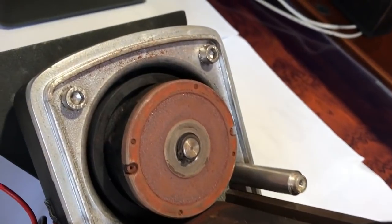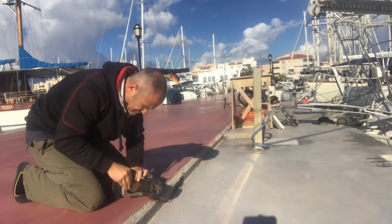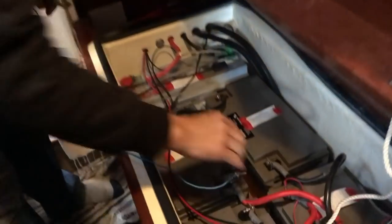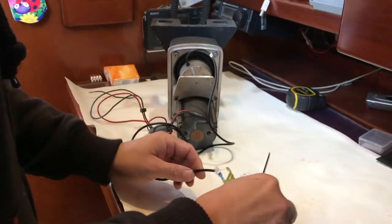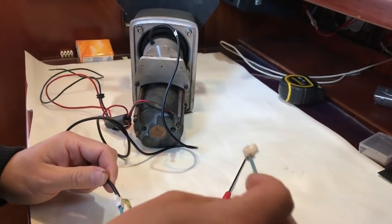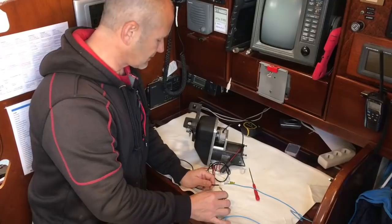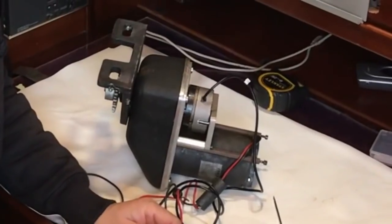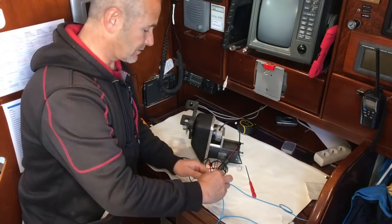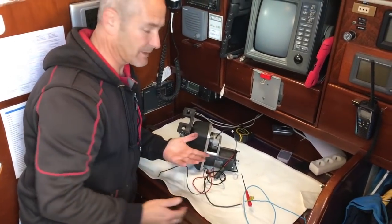After Ant's excellent tutorial I had the confidence to put it together and reinstall it myself. Because the clutch is a 12-volt clutch, I connected it straight to the batteries. We had it freewheeling on the clutch switch, and as soon as I connected the negative it should hopefully connect together. No smoking or burning smells this time — it was fully engaged. I think we might have done it.